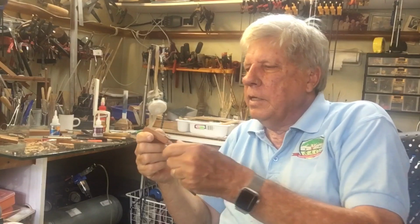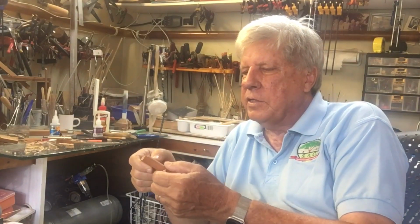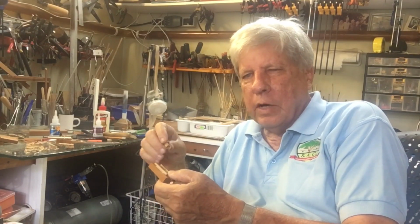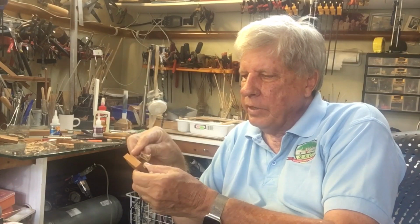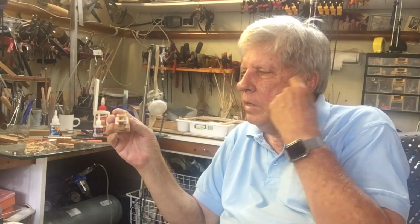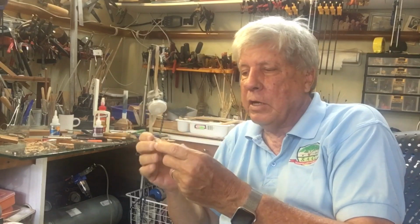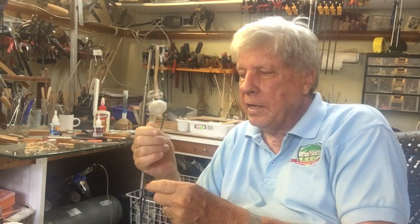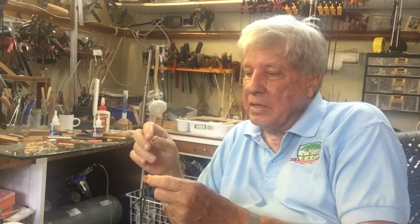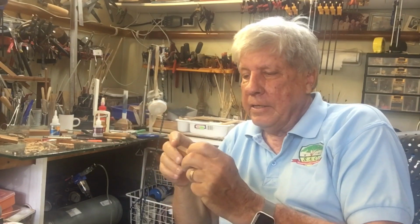What this jig did is it allowed me to set up the brackets with the transom and the ring bolt. I did not put in the 2 axles, and that was made up in this frame. I'll put it in upside down because it'll work pretty good. And then stuck that so they all come together, and I get the frame coming out at the correct angles. And then I put the 2 axles on afterwards. In a perfect world, I'd really like to put the axles in at the same time and stick it all. So hopefully I'll get a jig that will do that for me.